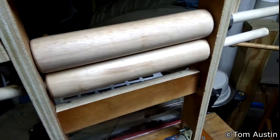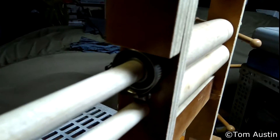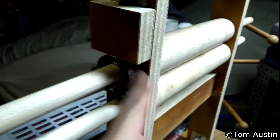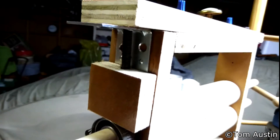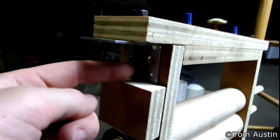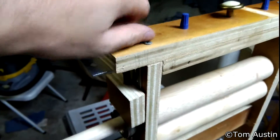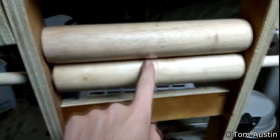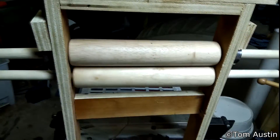It still spins but gets real stiff when I crank on it hard. For the axles I just have two three-quarter-inch dowels running through there, and those are bearing on a set of three-quarter-inch bearings held in hose clamps so I can have some friction to press on them. Up here I have a spacer and a bolt threaded into this bracket that runs to the top, so I can tighten and loosen it to put pressure on the bearing, axle, and between the rollers. As you can tell, it's terrible and doesn't work very well.